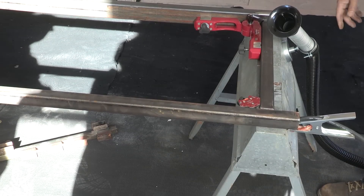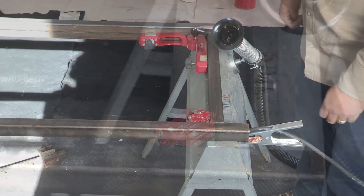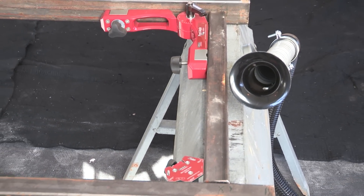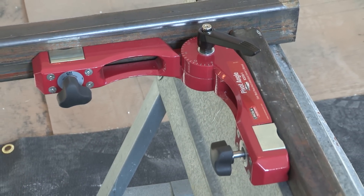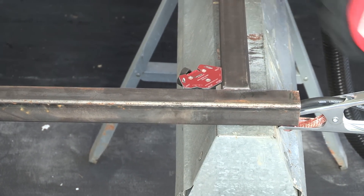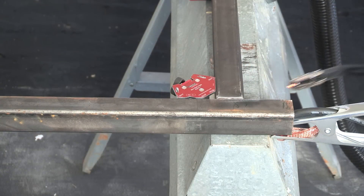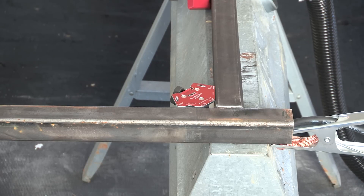The first step is getting all your material prepped. Everything's cut and ready to go. We've cleaned off the mill scale with the grinder to make sure everything's squared. We have some Lincoln Electric tools here — a mini multi-angle unit and the pivot angle — just to keep everything so it doesn't move. We're going to tack weld a little bit to hold everything in place as we get all the other stiffeners in place. Our MiniFlex unit is wired with the ground so it'll automatically turn on as soon as it senses voltage.